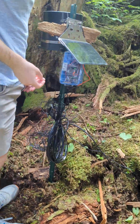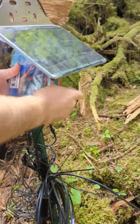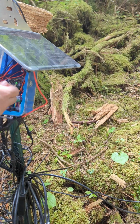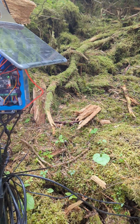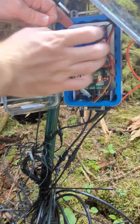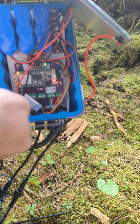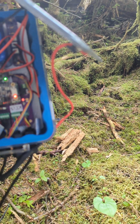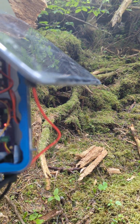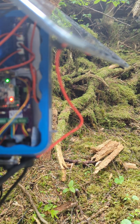Okay, so for inserting the new SD card, it's basically like taking out the old one, but in reverse. You still want to start with opening up the Chime. Then to make the SD card easier to access, just pull on the batteries to tilt it up diagonally. Then you just insert the SD card into the Hypnos board until you hear it click, which is a little bit of an odd angle to do this at, so it might take a little bit.